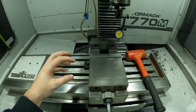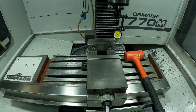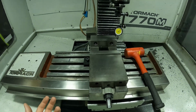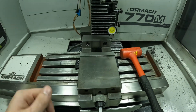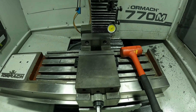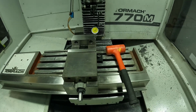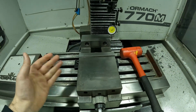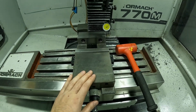I can just either put in the rapid turn and rotate. It's my cheap person's fourth axis, because then you can also use it as a lathe, so that works good for me. But really just a vise is everything I need. I make soft jaws when I need, and I just do it like that, and it works great for me. So this job's done. This vise is all trammed in. It's great. Maintenance is done on it. Table's cleaned off. Not much else we need to do.